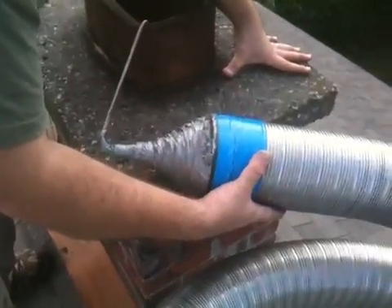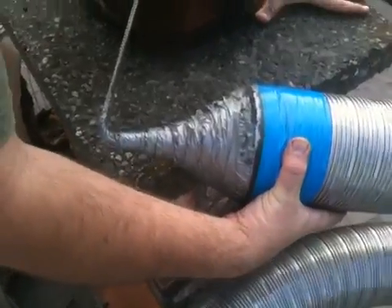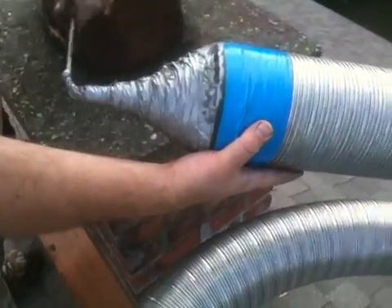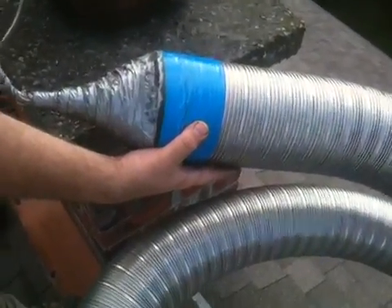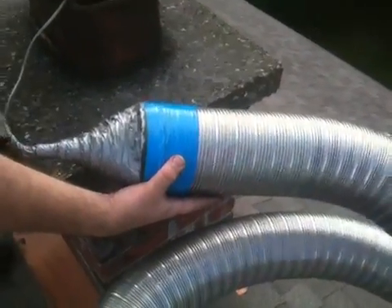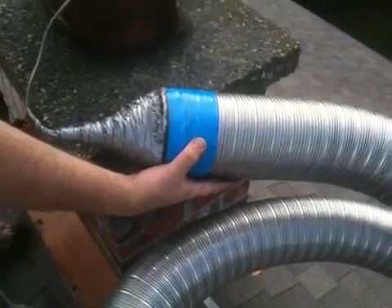This is Roland — he is a very good chimney installer. Here's his secret: he tapes a little funnel to the bottom of the liner so that he can pull it from the bottom if it gets stuck somewhere. Now we are going to shoot it down the chimney.